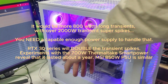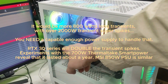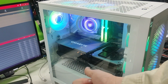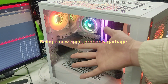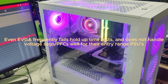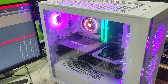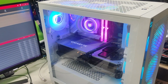This card here, a 4090, requires above 1200 watts. If you put in 1000 watts, this thing will transient past 1000 watts. It will not last. That power supply, even though it has the power excursion, no one knows what the specs are going to be like down the line. I mean, it's like a temporary kind of thing, yeah? How long is it rated to last? No one knows. And how stringent is the quality control of the spec? No one knows. Companies would vary from quality to quality, obviously.